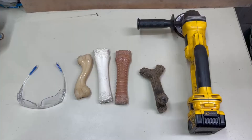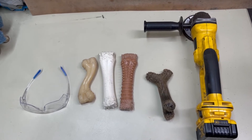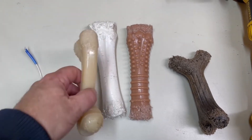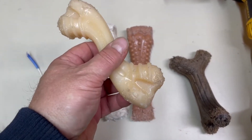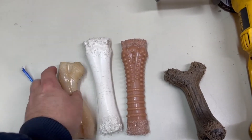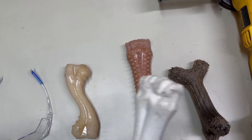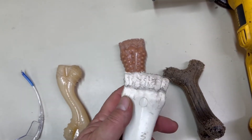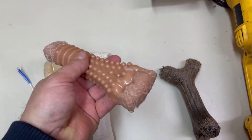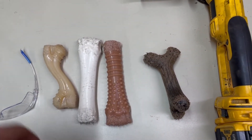Well there we have it. The white one was the easiest to clean up — the material came off really nice with the flap sander. I was even able to bring back the grooves that were originally there as best I could. The brown one was the hardest — you've got to watch that it doesn't get too hot, because it wants to flow and move around rather than get removed. A sharp knife helps with cleanup too: once you get some of the lighter areas, you can just scrape that right off. This one here wasn't too bad, kind of like the white one.